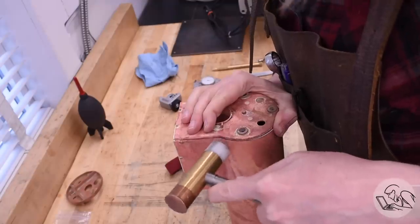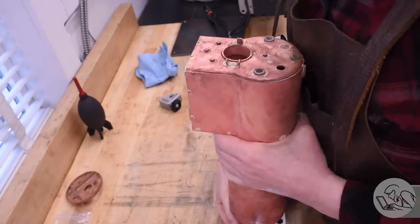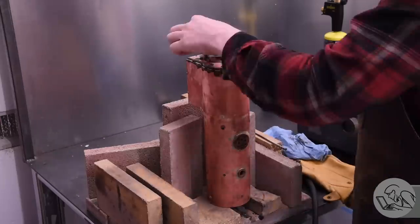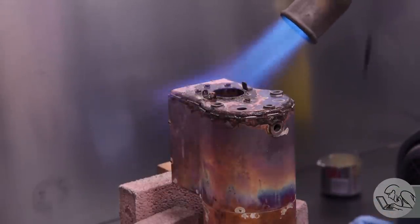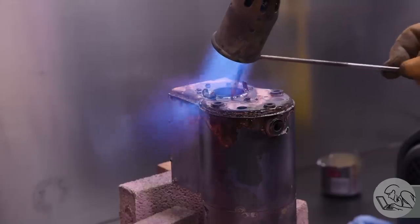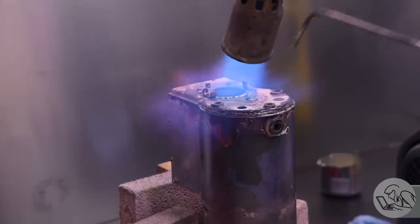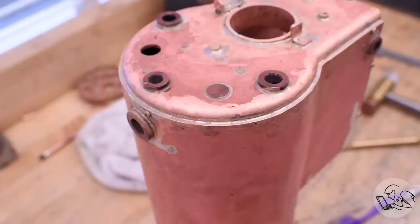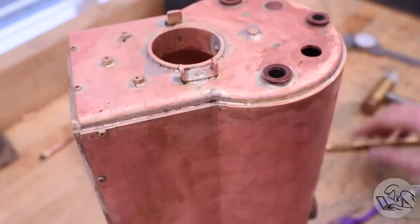Now it's time for the back head — this is a big one. I did some tapping to tighten up that joint once again. You can use a flashlight through the other end of the boiler to look for gaps that might be too big. Once I was happy with all the clearances, once again flux and little pieces of solder in there. You might have noticed I'm using the big torch now — the two-inch tip. You cannot have too much heat now. It's heating up the entire boiler for every single joint, so you've really got to pour on the heat. I poured it on and this seemed to go pretty well. I'm soldering the outer joint, the fire door ring, and all the stay bolts on this back head all at once — the setup Kozo says to do. That went really well. I'm kind of shocked at how well some of these difficult joints are going — a really nice looking seam all the way around, the fire door ring looks good, and all the stay bolts look good.